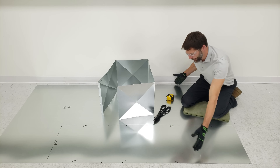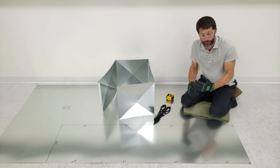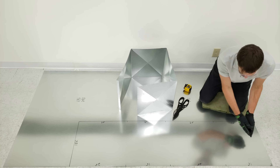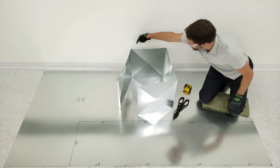I get a four foot by eight foot sheet of metal in order to cut multiple plenums out of, or make transitions or ductwork. In this case I'm making a 16 by 20 plenum, and I'm making the whole body of the plenum out of one piece — that's this perimeter right here.